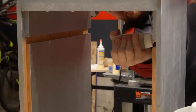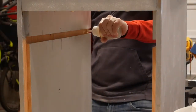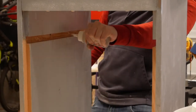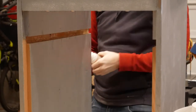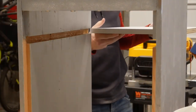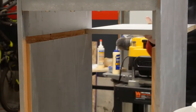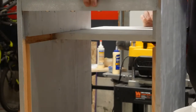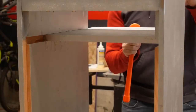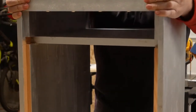When it was dry, I went and glued everything into place. I'm using Gorilla Glue clear non-foaming adhesive — I've never used it before and didn't really like it all that well. It's really viscous and took an abnormally long time to dry, even for a solvent based product. Sliding it into place revealed a little oopsie: when I faced this shelf earlier — a deviation from the plans — I forgot to cut the corresponding amount off the back, so the end result was it was too long, but an easy fix.